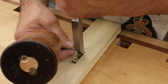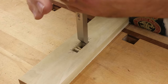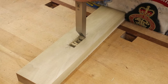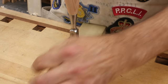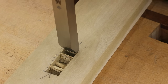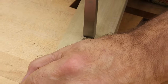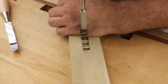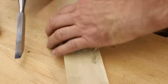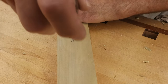To finish this, I have it facing me. I'll split that ramp in thirds down to the depth mark. Still not on the mark. Last chop — set the chisel so it's right on that gauge line, get it started, turn it sideways so I can see plumb in this direction. Just enough to break it free. Now I can go in and use a narrower chisel, prying against my hand. These fibers, for the most part, are already cut free — they just need to be pulled out. They're just wedged in there, not really connected to the bottom or the sides.